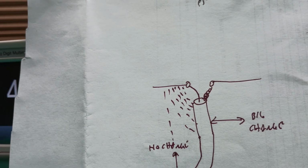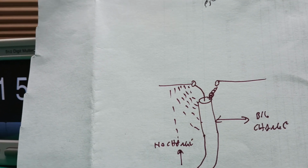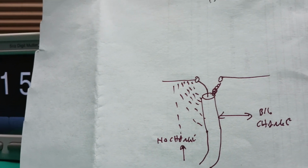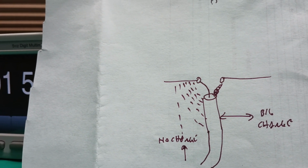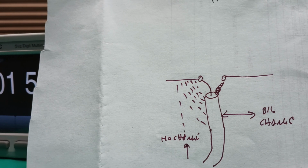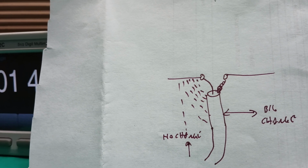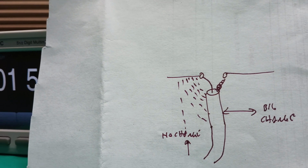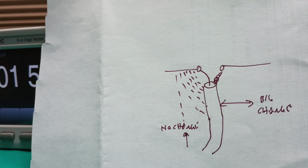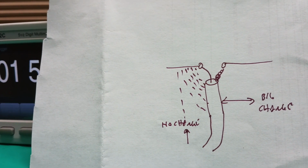The 2 coupling mechanisms, the lead wires coming up to the ends of the antenna wires, between the antenna wires, total capacitance there may be a half a tenth of picofarad, but several picofarad between the wires and the shield. And that's the coupling mechanism that results in the sensitivity of a dipole with regard to the length of the transmission line. The length of the transmission line towards ground doesn't matter because the coupling is not from the wires all the way down the coax to the ground. Partway down, the lines of force will jump off and couple with the earth.